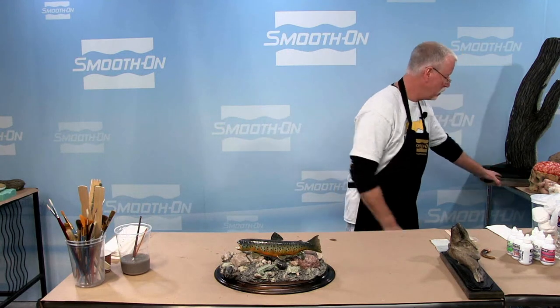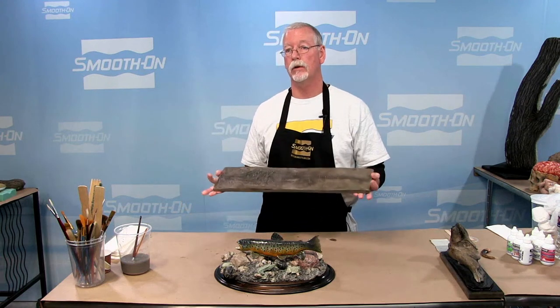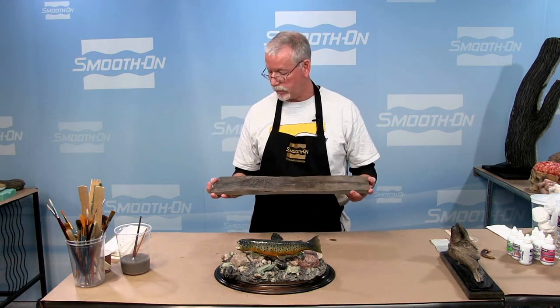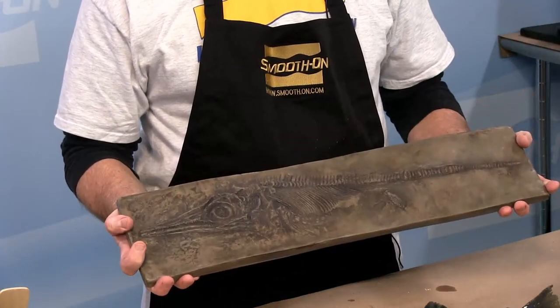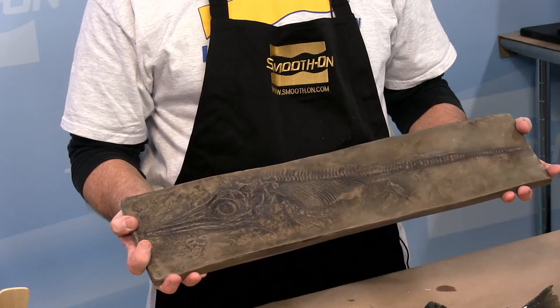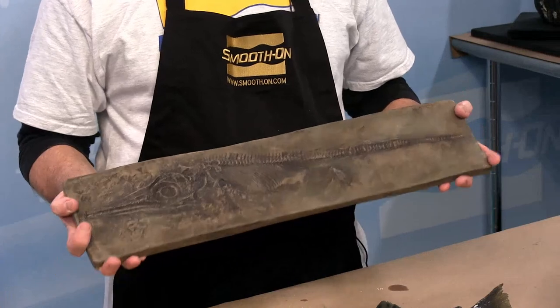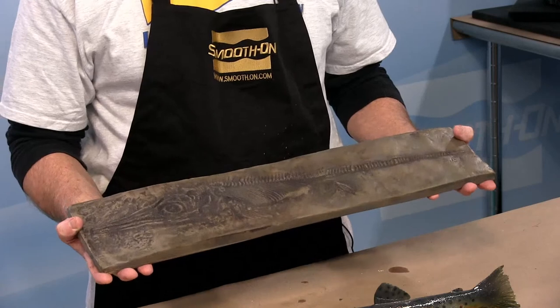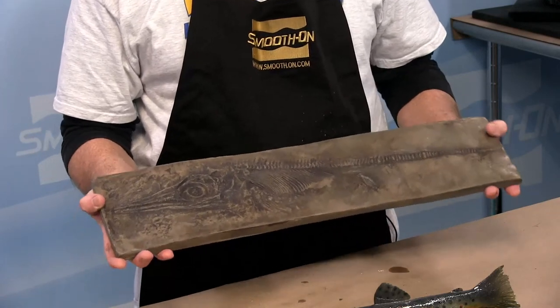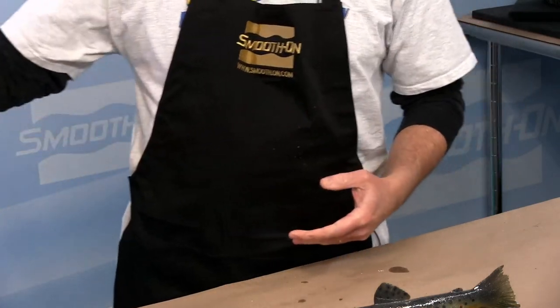They were putties, but we also have our Habitat casting coat, which you can pour into a mold, so you can cast into that. This is fire rated also. This particular piece, I just added some darks into this fossil, into the lower areas. I left the existing color of the piece as the higher, the lighter areas. I could have gone and done a dry brush on the higher areas, but I kind of liked the look of it, so I left it like that. So that's a pretty cool material also.